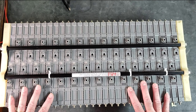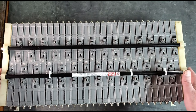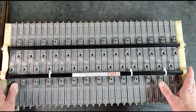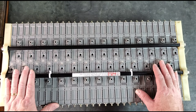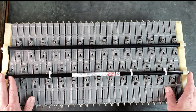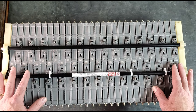If you don't know how to remove these and get to this point, you can check out one of my other videos. Leave the bars on the top and bottom and the end caps in place, because when you're doing this refurbishing process it's going to be charging and discharging the battery, which creates heat and causes the battery to expand. Without being held in this case, you risk the battery blowing up, or at least expanding and leaking. So you definitely have to leave these batteries under some compression.